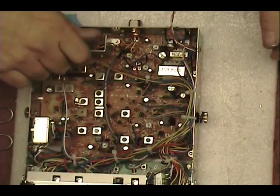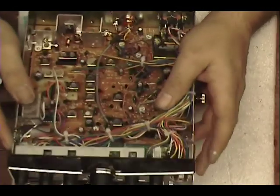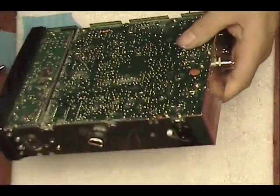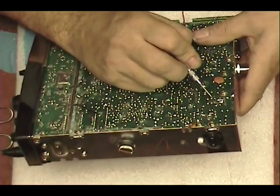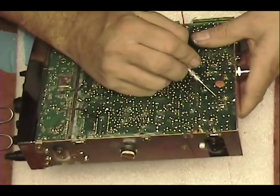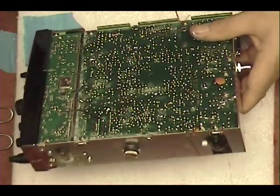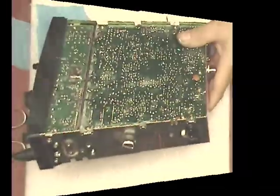I'm going to check this out. Just check your work — even if it looks like there's nothing between your solder connections, it's good to drag a pick through there. Sometimes it'll flick out something you didn't see, especially if you're as old as me.